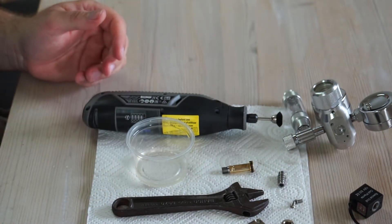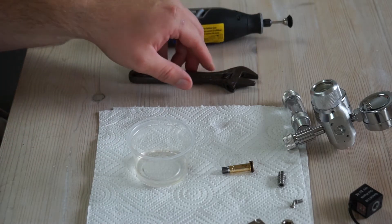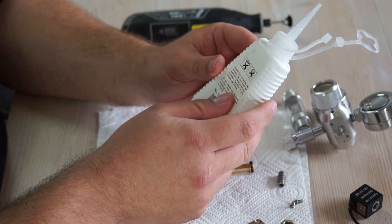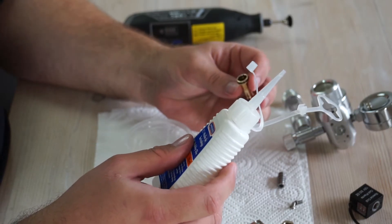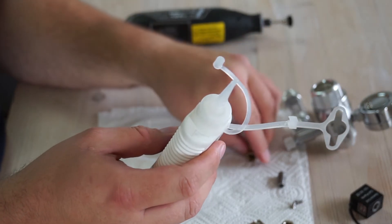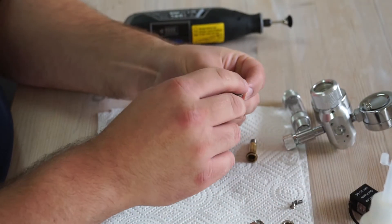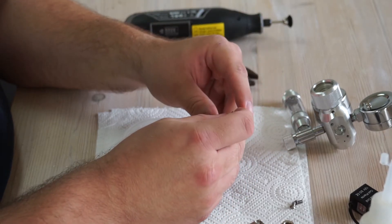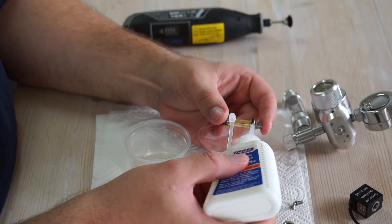It's that simple — you just need the parts to be clean. Before reassembling I'll take an extra step and lubricate the parts slightly. For this you want acid-free oil — nothing corrosive, and this one should even be harmless to the fish. You don't need much: just a couple of drops in the tube and a drop on the plunger, making sure it's pretty well covered. Then reinsert the plunger into the tube. I'm also going to lubricate the o-ring just to make it slightly easier for it to find its seating — I don't want to damage it.